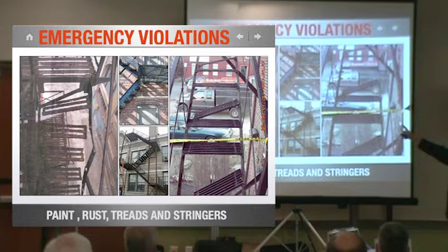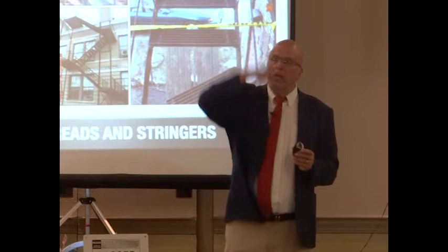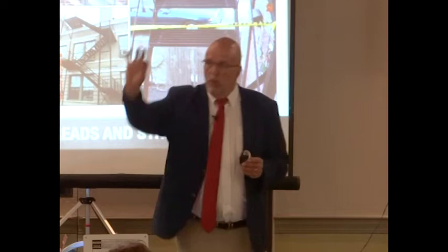Hammer test, by the way, somebody asked me a question there, when do they give out? This much, 1/16th, fails in a hammer test. I use a 3-pound hammer, and I'm going to show you a video of us. So for our safety, we go ping, ping, ping, pong. There's one of these that has given way with a 3-pound sledge, baby sledge.